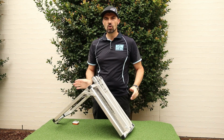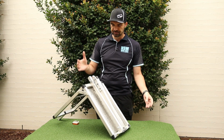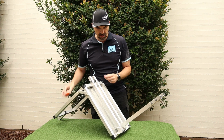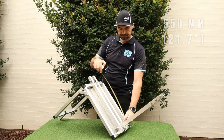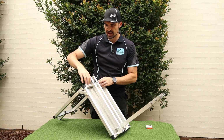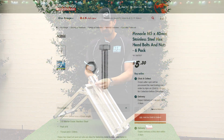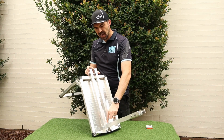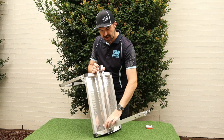And the next thing, once you've got that all put together, is the base part of the frame that we want to use to connect to our golf cart. So what I've done here, first of all, is these 2 long sections. There's 2 of these, and they are 550 millimeters long. They are bolted to the front and the bottom, so both bottoms, front and rear. That's just using some bolts, M5, M6. The way I've spaced it out is that there's a gap at the front for the upright tube to go in, so it's about 25 millimeters apart. So you can see that goes in there.